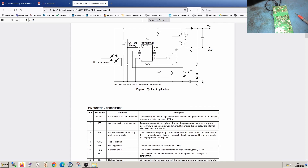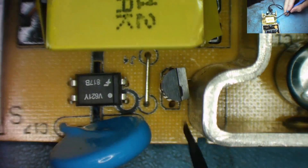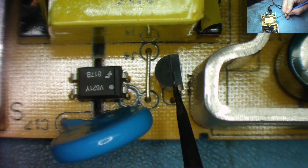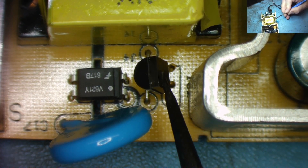The thing that sets the operating voltage is this device shown as a zener diode. But on our circuit, I think we won't find a zener diode but instead a small IC called the TL431, which is basically a programmable zener. Let's look at our circuit board — this is our opto-isolator, and this little device that looks like a transistor will certainly be the TL431 or something similar.